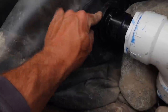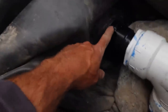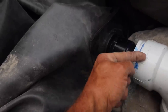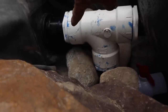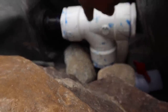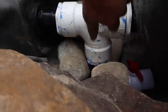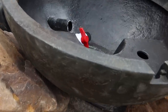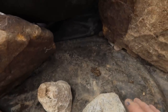Here's that finished product: the rubber gasket always goes on the water side, so we've got the rubber gasket and then the rigid hard plastic gasket on the outside of the liner, as well as the collar nut. Then we've got our MPT, a little chunk of two-inch pipe about three inches long, that goes into our three-to-two reducer bushing, then our three-inch tee. The sweep of this tee comes down — you don't want to flip that and have the sweep going backwards. Water flows this way, so we want to use that tee to its advantage with the sweep going with the flow of water. We've got our ball valve down in there; we'll trim this pipe, bring this ball valve in close, lock this stuff together, and get a rock right in here for that water to swell up around.